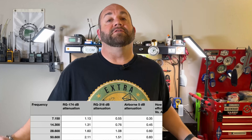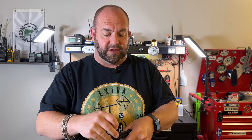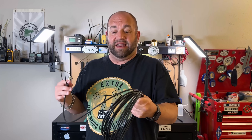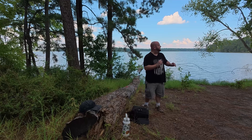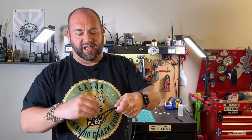So there we have it — the proof is in the pudding. Here are the numbers at the bottom of the screen if you want to pause to scrutinize them. The Airborne 5 is a more efficient cable while maintaining incredible light weight. I was at the Huntsville Ham Fest giving a presentation at Giga Parts, and I passed this cable around — people couldn't believe how lightweight it is. From a user's standpoint, I've used this cable over 30 times doing POTA activations. The jacket is really strong, so I'm not worried about people trampling on it, but it's also really flexible given that it's a solid core coax. Over-under method for winding, you can just throw it out and it unwinds — it doesn't kink. It's a very, very nice, lightweight, easy cable to use. I love it, and it is very, very efficient.